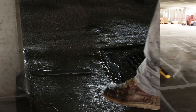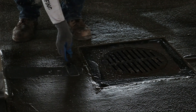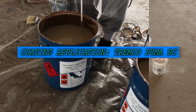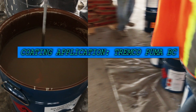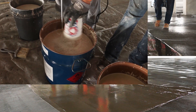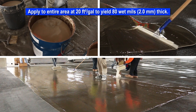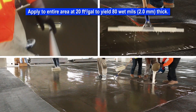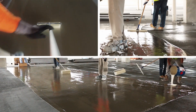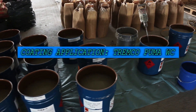All drains should be cleaned and operative. Drains shall be recessed lower than the deck surface. Surface shall be sloped to drain and provide positive drainage. Mix Tremco Puma BC for 2 to 3 minutes prior to the addition of Tremco Puma initiator. Apply Tremco Puma BC at 20 square feet per gallon to yield 80 wet mils, 2 millimeters thick, to the entire area. The recommended method is a metal notched rake. Spike roll Tremco Puma BC immediately to release all air bubbles from the coating. Allow the base coat a minimum of 45 minutes to cure.